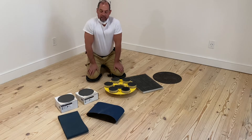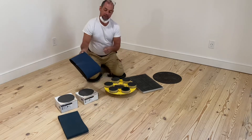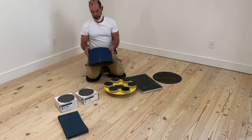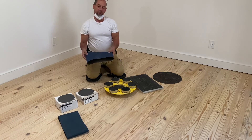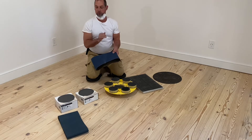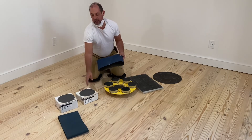It saves a lot of time and trouble to follow up the edges with an 80-grit drum sander. You just have to be careful to set the drum down and give it a really smooth motion. And that will help clean up a lot of the 80-grit edges.